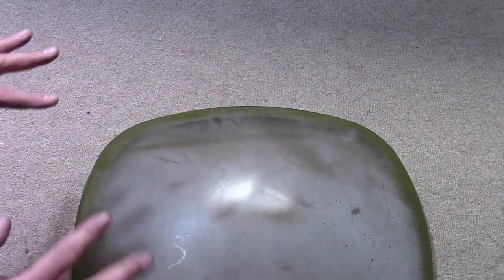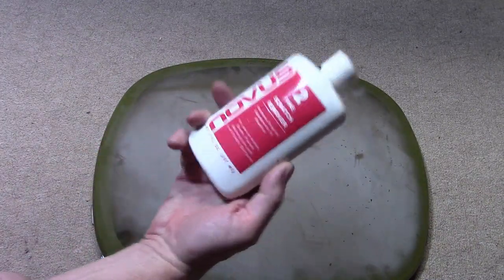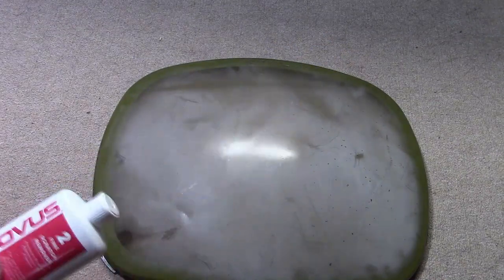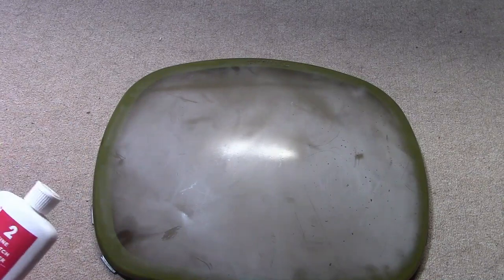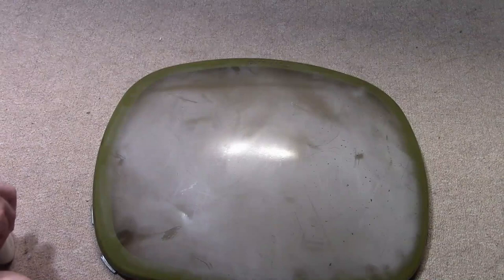What we're going to do today — especially since I just picked this up last weekend and want to check if it's defect free — is simply clear some of this cloudiness off so I can see if there are any cracks. I'm going to do that with Novus No. 2, a plastic polish with a fine abrasive material. There's nothing magical about it really — it's a little bit finer grit than, say, baking soda. We're going to use a microfiber cloth; I get them in cheap packs from Amazon.